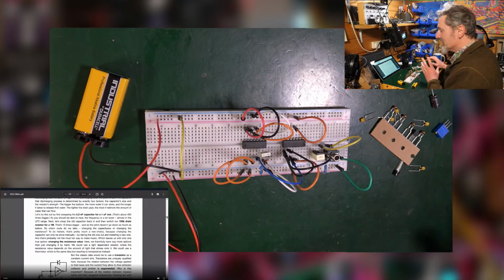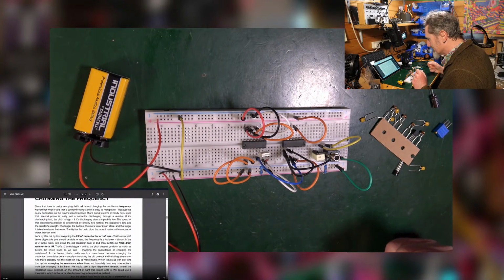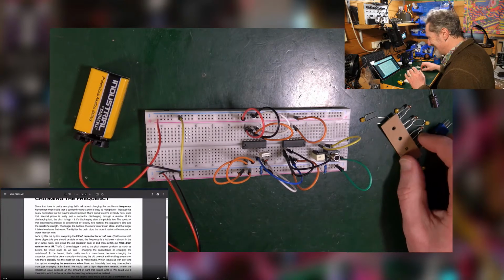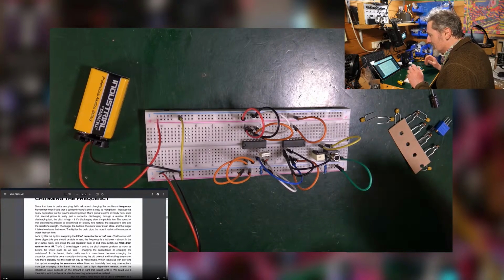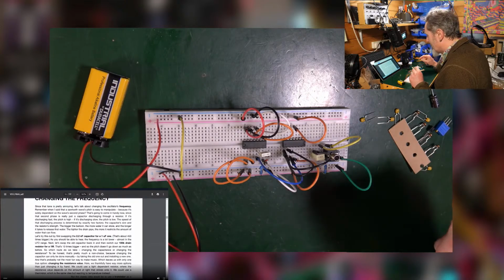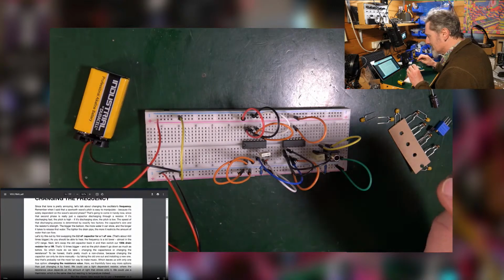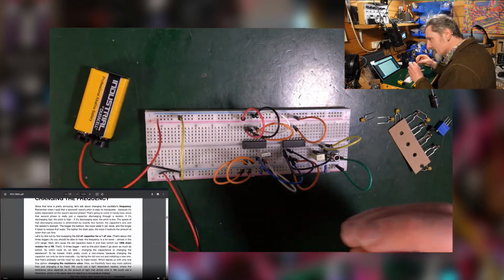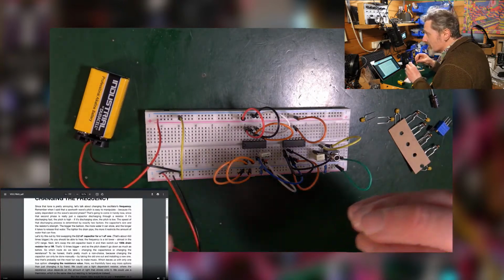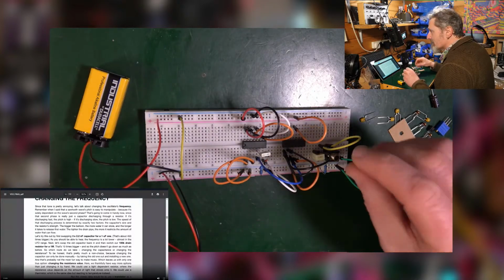Right. Bit more learning coming up. Changing the frequency. This could get interesting because we might start swapping capacitors. Okay. So let's talk about changing the oscillator's frequency. Remember when I said a sawtooth wave's pitch is easy to manipulate because it's solely dependent on the wave's second phase. It's the drop away from the capacitor which lengthens that decay, which essentially lengthens the waveform, which reduces the frequency because its wavelength has increased, which makes the pitch lower.